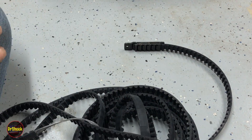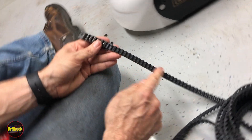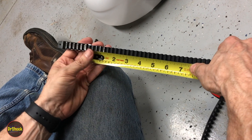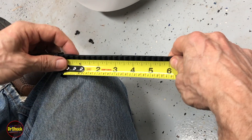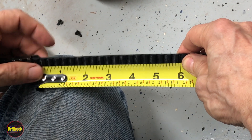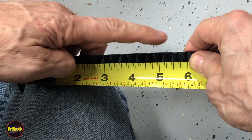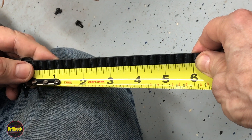When you go to replace it, the first thing to look at is the number of notches in the belt. There's a specification: 20 notched grooves per six inches. If we set this and measure from one notch, counting up - one through twenty - you want to make sure you've got twenty notches for every six inches. That's the first check.